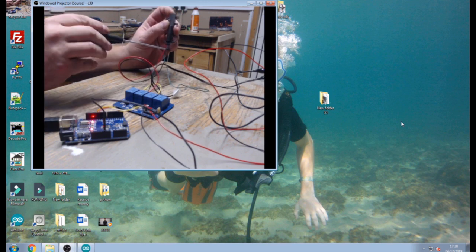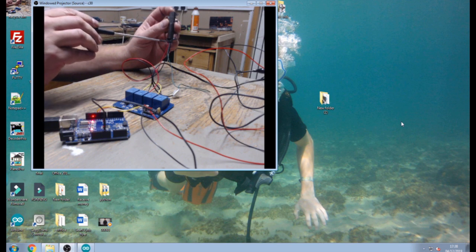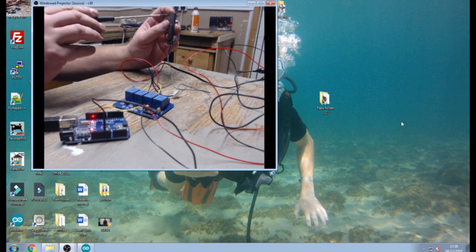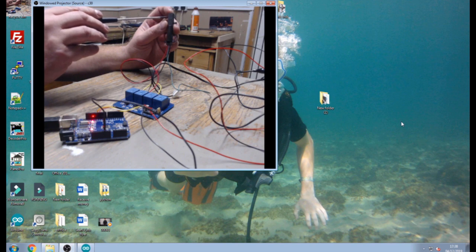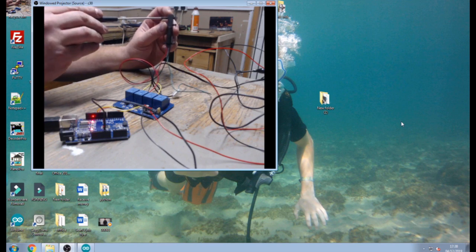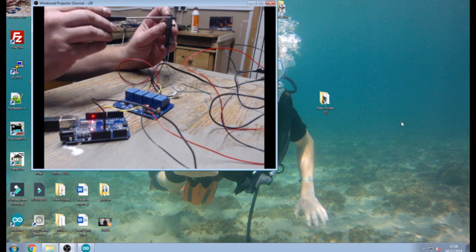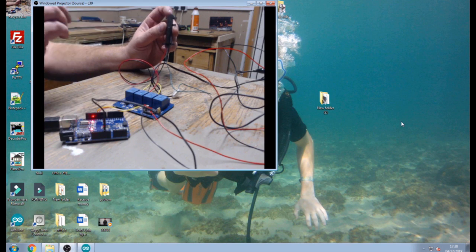Some people probably have used these before. The green cable is the common to your AC power supply, or one side of the AC power supply. The red cable and the black cable pulse to the other side of the power supply depending on what way you want your turnout to throw. So if I operate a pulse on the red wire for one second it will pull this turnout over to me, and a pulse on the black will put it back to where it is now.